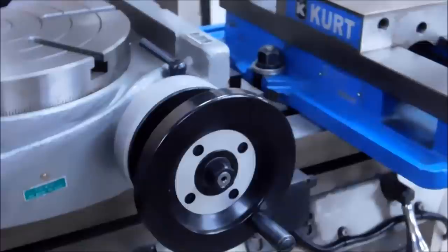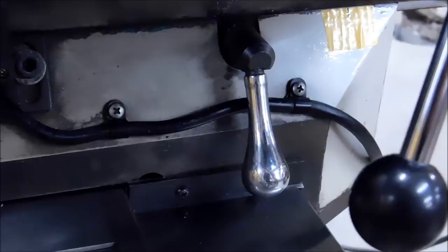These guys in the front underneath are table locks for the X-axis. When you snug these up you can have a little bit more fun climb cutting because the table is not going to have a tendency to run away from you. A Y-axis lock is on the side, and the Z — which is up and down — is right here in the back. This is an oiler for the machine: as you depress this it forces oil through all these lines and oils the machine.